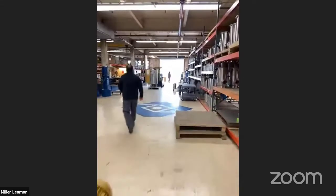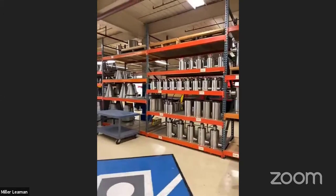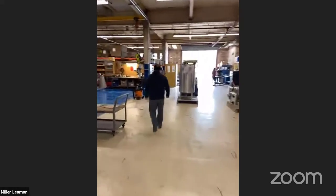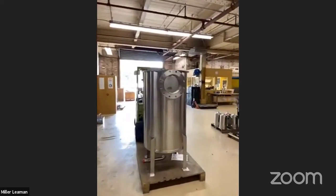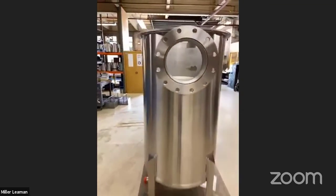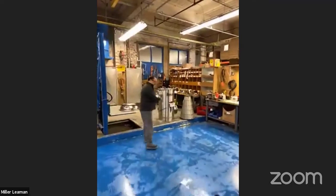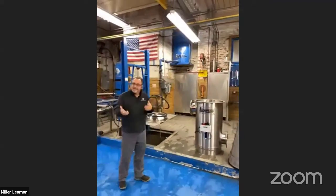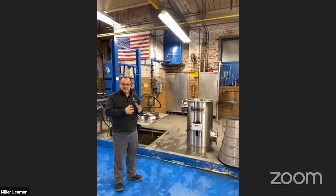That's a pretty clean factory there, David. We have a bit on hand in inventory too, so we can deliver within two to three days on mostly any of our Thompson strainers. We'll show you a big one right here - this is going to a pharmaceutical facility. This one is a 10-inch, and at the bottom you have legs and a bottom flush port. The eight-inch Thompson strainer is designed for roughly 750 to 1,500 gallons per minute; we recommend around 1,350 gallons per minute, which is around eight feet per second through a line.